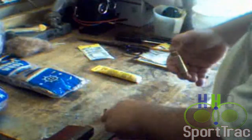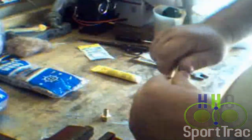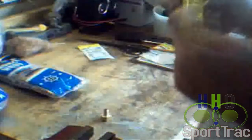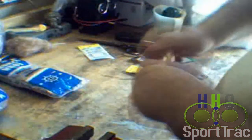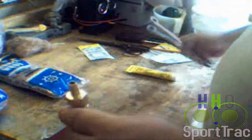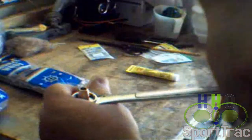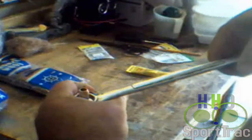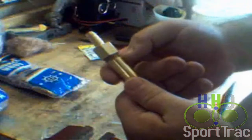Basically, it wants to come out. Take your barbs. At this point you would put Teflon tape, Rector Seal, or Permatex on the threads to seal these up. Take the other side and close it up. I put them in my vise just to make it easier — it is a three-quarter inch fitting. Tighten them down; you will be able to get them tight all the way to the bottom.